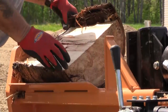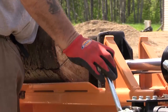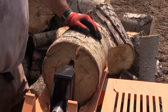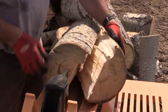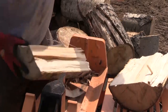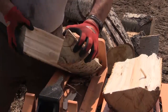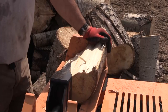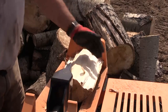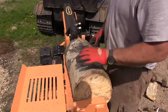I've used other hydraulic splitters that were so slow you could have coffee between strokes — not this one. When it comes to power, out there on the market there are ones running 12 to 15-horse motors and ones claiming 45 to 47 tons of splitting power. I've used them from about 17 ton up to 35 ton. Once you get over 20 ton I've never stalled one, but some seem to punch way above their weight class. I think it's probably because there are no rules or regulations on what constitutes '27 tons' or '30 tons.'